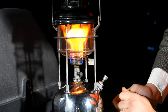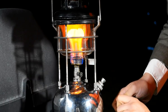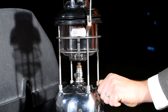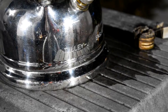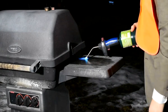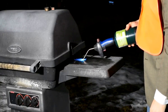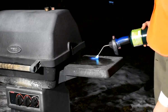And something is wrong — the pump pushes back out of the tube. If I pump it a couple times it'll stay down, but only because kerosene has gotten around the cup and is leaking out of the top of the pump. With gasoline this would be a little dangerous, but kerosene isn't that volatile, so it's a lot less scary. The kerosene won't catch fire without some kind of wick — this is one reason some people prefer kerosene.